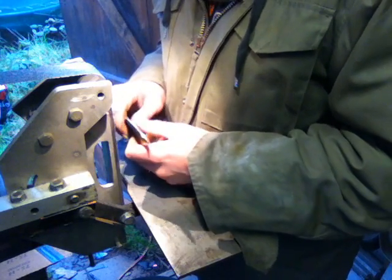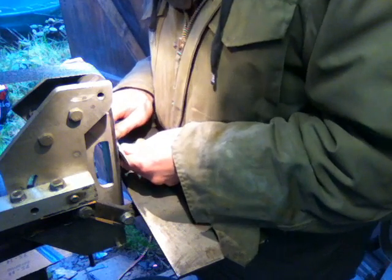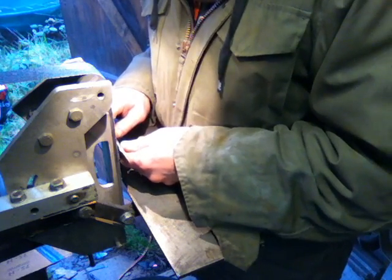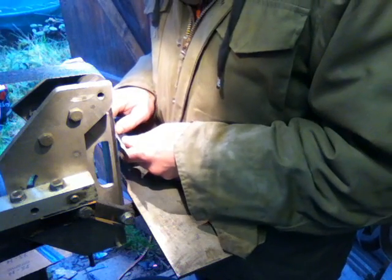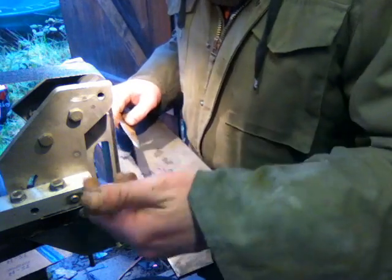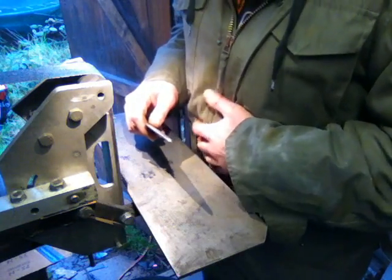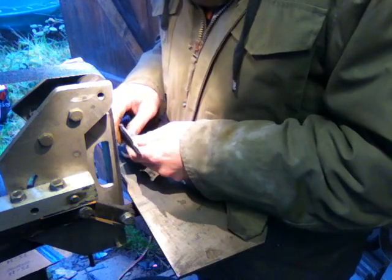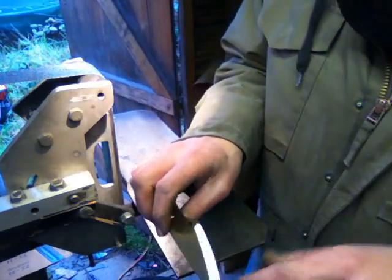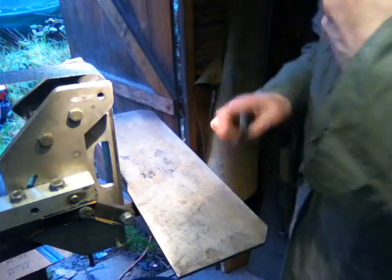And then my arms are locked in just lightly, and my hands are slightly above, probably about 5 mil above the actual tool rest. So I'm not dragging across it or anything like that. I'm just floating above it, all right? For all I care, this could be a stick coming out here with some sort of cushion on it just to keep me comfy. You know what I'm saying? Because all it's stopping me from doing is rocking in, and I'll get a consistent distance. So I'm going to follow this grind up a little bit more, give myself a smiley face and show you how I rectify that.